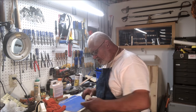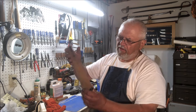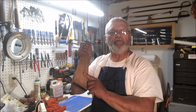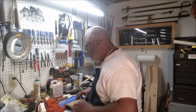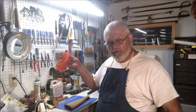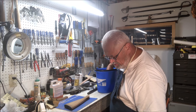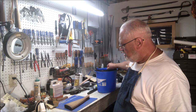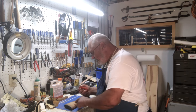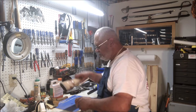We're back. We've done our sanding, gotten all the old finish off, and we still have the areas with the dents that we're going to try and raise. In order to raise the dents you need water and heat — you're going to steam them out. We've got an old washcloth and a bucket of clean tap water. We want to put water right on and into the areas, the dents that we want to raise, and that really makes them pop out.